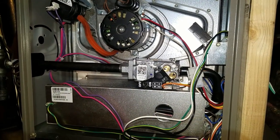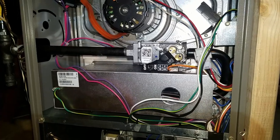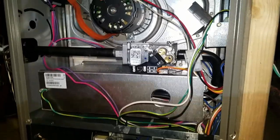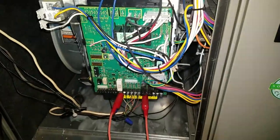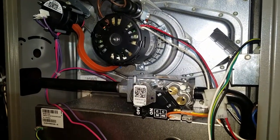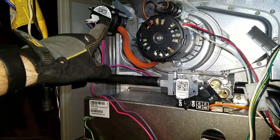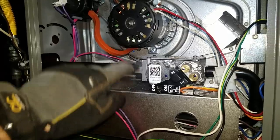We're on a no-heat call. This is a brand new Lennox furnace, only about a month or two old. Air conditioning and fan all work. I came up into the attic — it's an upflow in the attic. The inducer is not coming on because I got an error code on the board saying the low pressure switch didn't close, because this unit is not creating a vacuum.